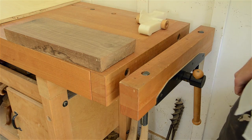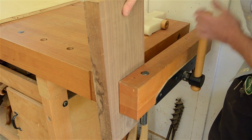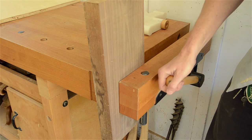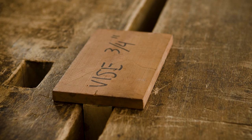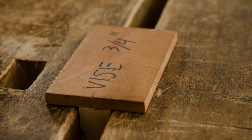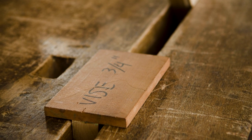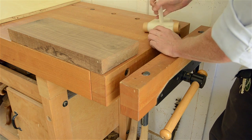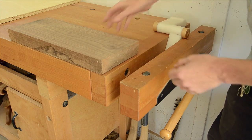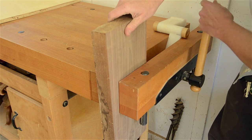As I mentioned in my last video, certain types of vises like this European style vise can rack or get stretched too far if you don't have some sort of spacer on the other side of the vise. Some people make little spacer blocks of various widths to put in the vise, but they don't seem to cover every board thickness so it's always a little loose. If you dimension your own boards you're going to need more flexibility. So in my school I use this extremely cool vise rack stop. It's made out of plastic which lets me micro-adjust for pretty much any different wood thickness and keeps the vise nice and tight and prevents racking.